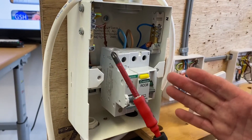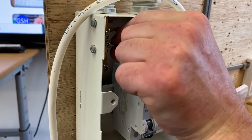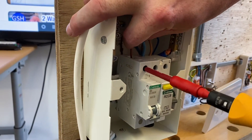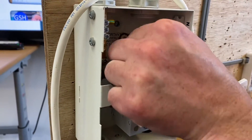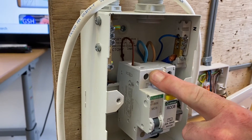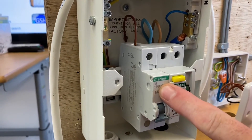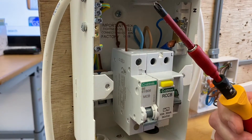Our highest reading for continuity of CPC is 1.2 ohms, which we record under R1 plus R2. We confirm the switch is turned on at the lighting point so we can tick the polarity box. We now need to drop the line conductor out of the earth bar and return it to the required torque setting — in this case, 2.3 Newton meters — in the top of this Crabtree Starbreaker 6-amp breaker.